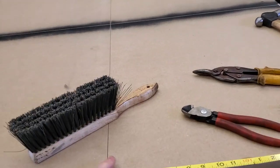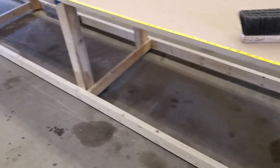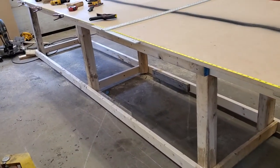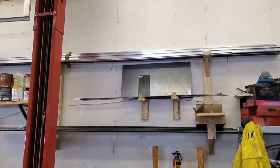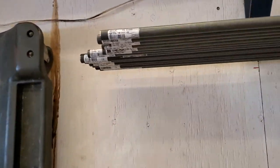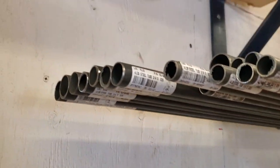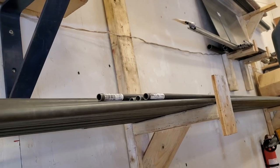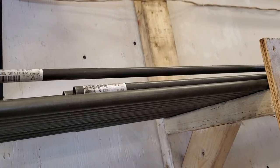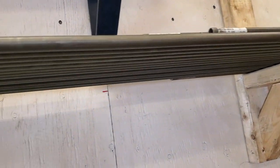The top is three-quarter inch MDF, or fiber board. My tubing is up on the wall — it's all 4130 chromoly, a bunch of different sizes with a few different wall thicknesses. Most of it is 0.035 wall thickness, but there is some thicker stuff — I think the next size up is 0.047 or something like that.